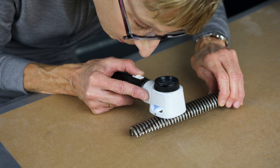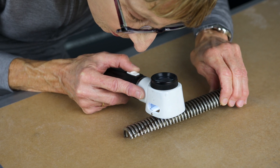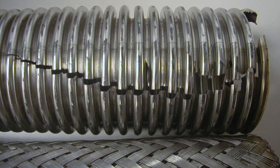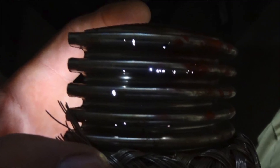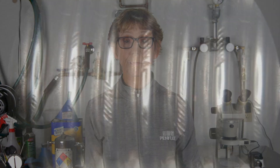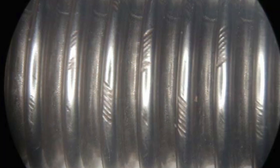I see cracks in the hose. Sometimes I see a hole in the hose. Sometimes I see pitting corrosion from the inside. Sometimes I see scrapes or damage from something rubbing on the outside of the hose, or distortion of the braid that looks like it was twisted. When there are braid marks, I suspect vibration or at least relative movement of the braid against the crest of the corrugation, which makes the wire act like a tiny saw cutting into the hose.